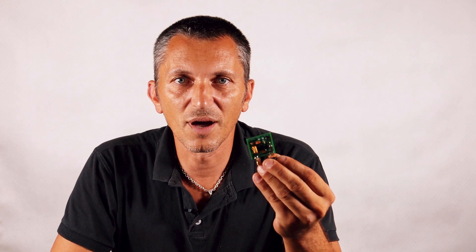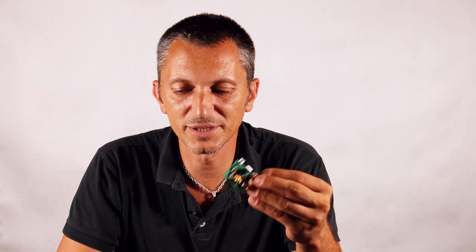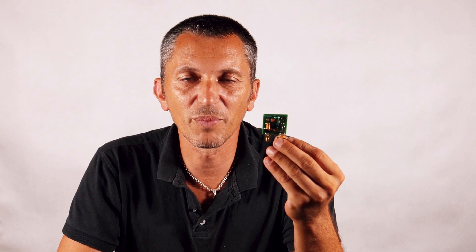We'll get to it on the table in a little bit. He tested the output — if you remember from the article, I mentioned that I did not have a tiny SA when I built this one, and it's the same story with the PTTico CW transceiver — to measure the output harmonics of this simple transmitter. I wasn't sure if the filter was doing a good job. And at that time I didn't really think about listening on the second harmonic on 14 MHz to see if I could hear the transmission I was sending on 7 MHz.